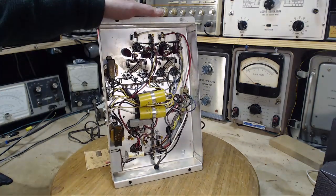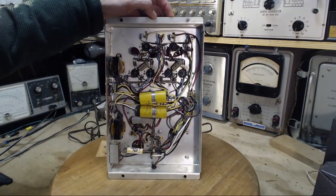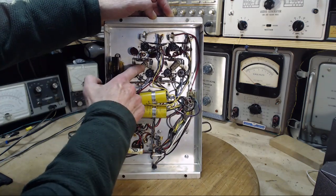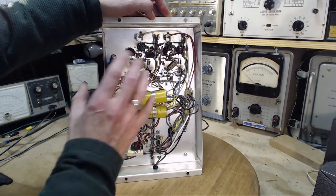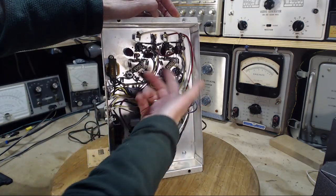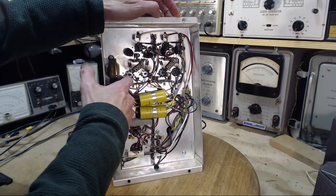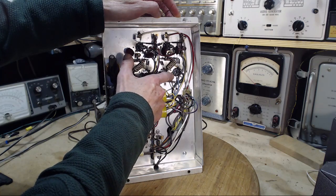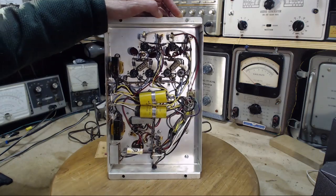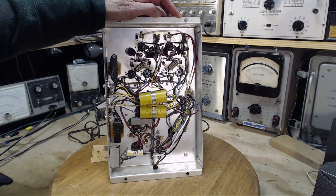Now let's just take a look at this while we got this up. We're halfway into it. Might as well finish off looking at it. So these are the 4 output tubes. You see some high wattage resistors. They look to be just fine. So I'm looking for evidence of heating, overheating, blackening, smudging up on the chassis. You know, signs of high mileage. I don't see anything like it. Here's a series of resistors going to the tubes, and not one of them looks any different. They all look fine. This thing looks like it's low mileage. This is what I'm starting to think.